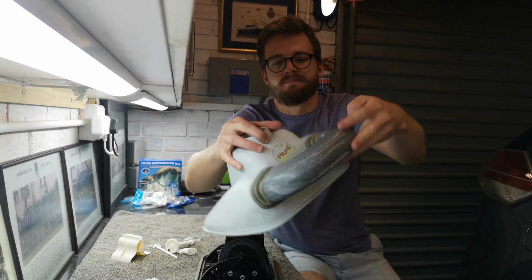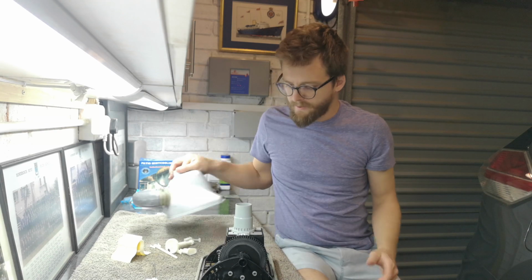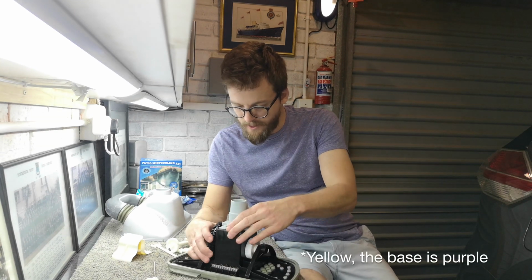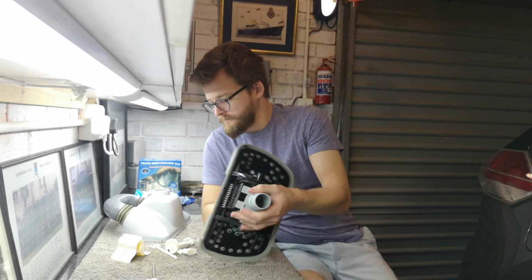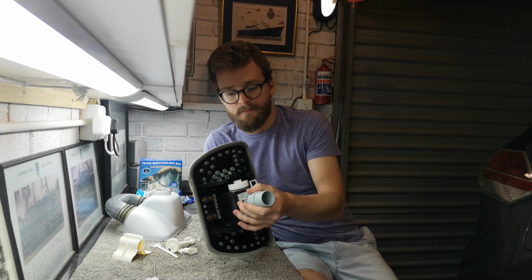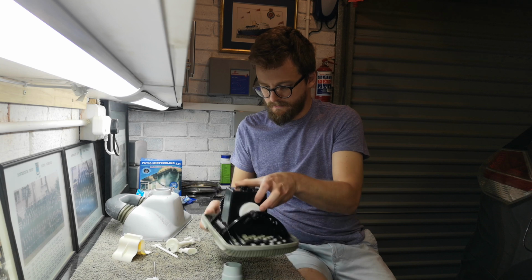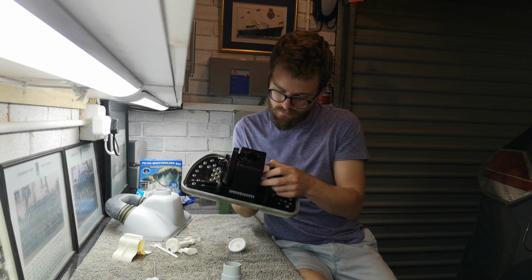These bellows, because this device just goes up and down like this the whole time, these perish and wear out. Easy, and you can normally buy those at any pool shop. Although normally not in grey, you can get them in purple, the original colour of the Creepy Crawly. Then, every now and then, there's a couple more complex bits that go. Not that there's a lot of complicated bits inside this machine. The one that goes the most is the clutch, which I'll shortly remove.